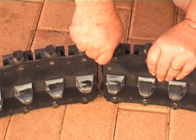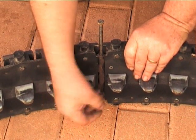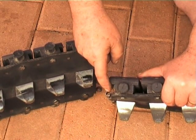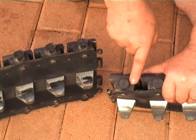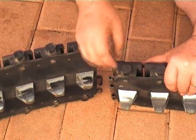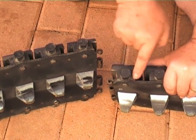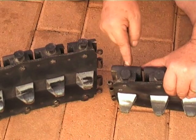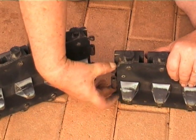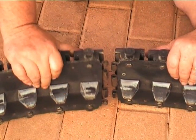That is pushed right through with a nylon core nut that screws on the other side. The actual butt blade here fits onto one of the track pads which has been rebated, so allowing the same height from one end through to the other, and is secured in firmly. This will now take all the load right through the conveyor belt or through the track.